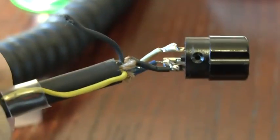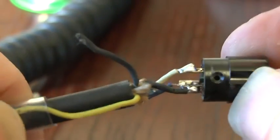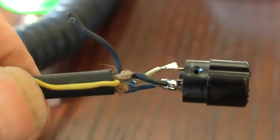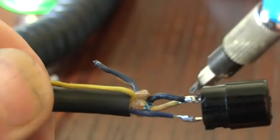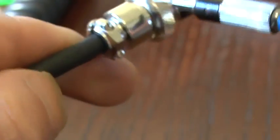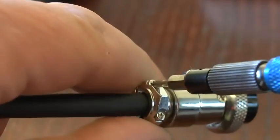Here we are, all soldered together. I didn't waste time on the video telling you how to make soldered connections — I'm sure you all know how to do that, and if you don't you shouldn't really be doing this in the first place. There's the audio connection on the white lead, and there's your blue for TX. The red and the braid are connected together under the heat shrink. Here's our microphone plug reassembled — just locking the saddle down to stop the cable pulling out.